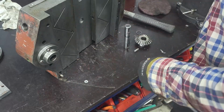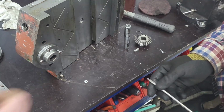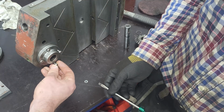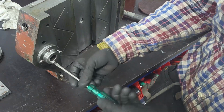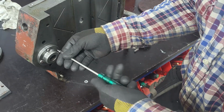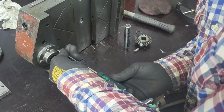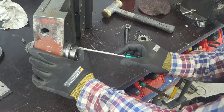I actually saw a cool trick for cleaning threads that we could show sometime. You just need electrical pliers. Yeah, I saw that one. It's quite fast. Then you just use a drill or an impact wrench or anything and clamp down on the threads. Cleans them right off. Convincing.